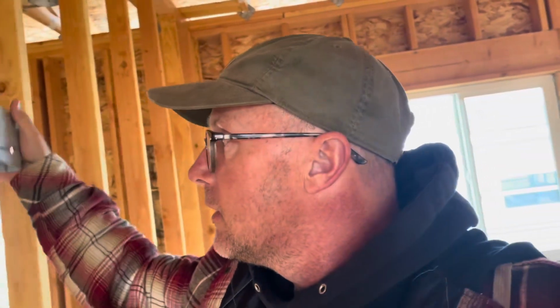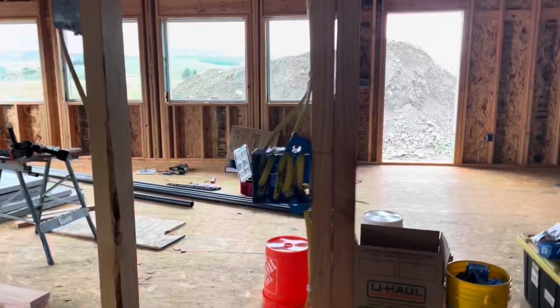I'm swapping out all my Cove heater receptacle boxes for the bigger ones because I will be jumping and adding several rooms. There's like one Cove heater in each room, and I'll probably put 2 or 3 on the same circuit. So there'll be multiple wires coming in and out of these thermostat boxes. I think I've swapped out all the others because I've pretty much done all the other wiring for the bedrooms and so forth.